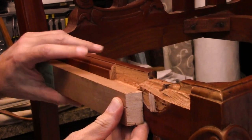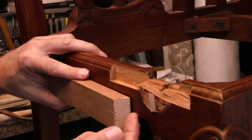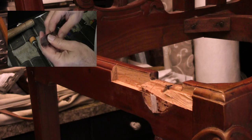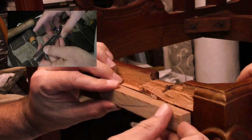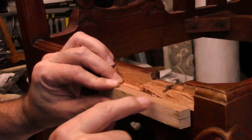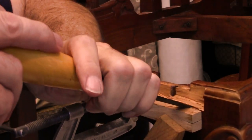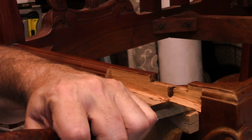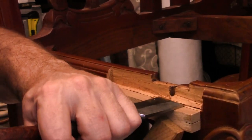Now we need to continue the bottom line all the way across so we can continue taking out the other half of the wood. The only problem is that we have this piece of the original arm that's still glued there solid and we don't want to lose that. I took the gouge and cut this little part out with the chisel, which left a semicircle — really easy, took two seconds. Now that'll span that and I can clamp here and there, which will give me the line all the way across. Look at that — comes right out. I always want to stay flat because I want to carry that line in, and this is going to give us this nice straight line.